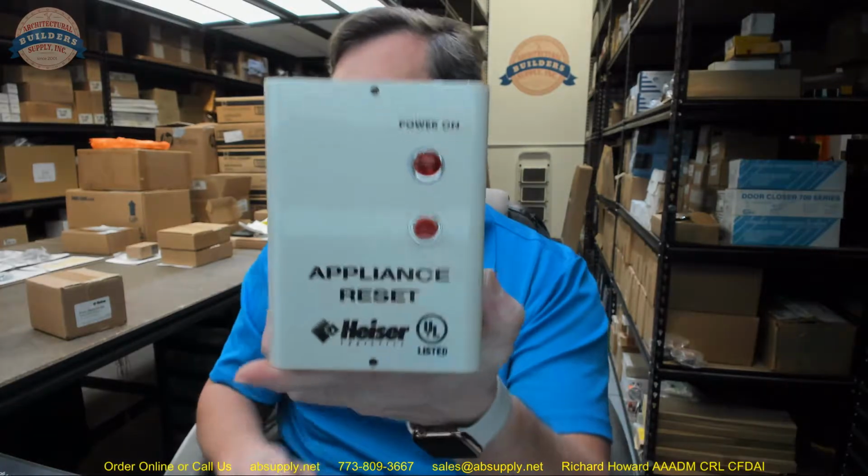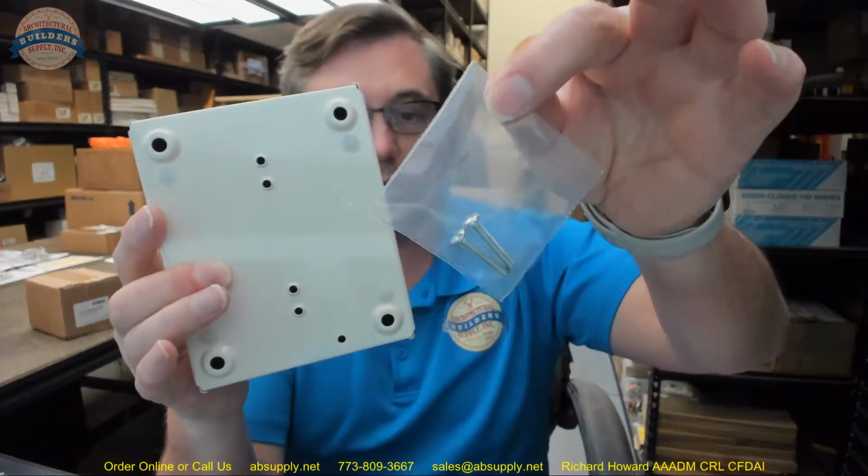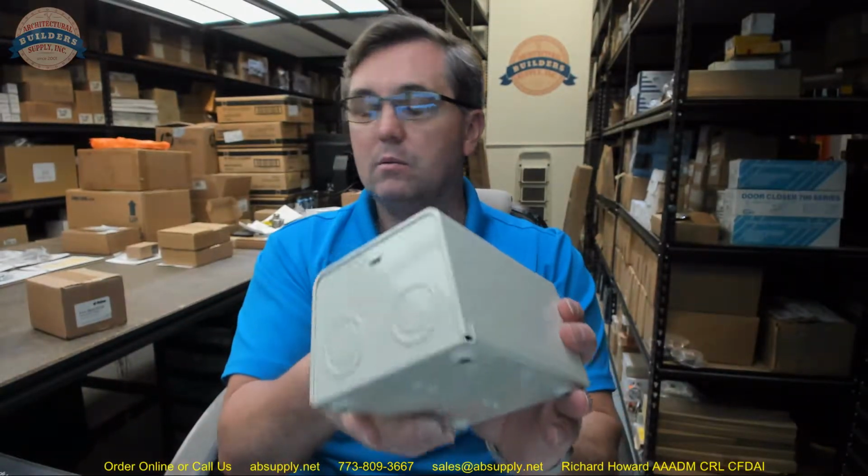Now, reading down through the rest of the installation instructions, you'll mount this in its suitable location. Obviously, you're going to be able to attach that. They do give you 2 screws if you're putting it onto a standard box application. Step 2 is to install your power: your hot or black wire to terminal 2, your white or neutral to terminal 5. Test the unit by jumpering 3 and 4 and pushing the reset switch. The relay should operate and the lamp should come on, so you should hear a click on the relay and then your lamp will illuminate. If the relay operates, remove the jumper from terminals 3 and 4. Install wires from the control switch to 3 and 4. Install one side of the load cable to terminal 1 and the other to terminal 5. Set the control switch to the closed position.